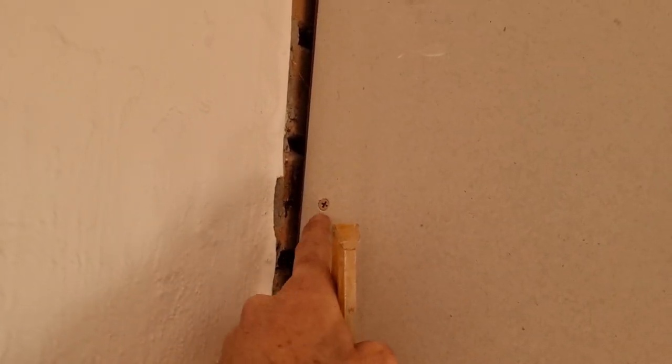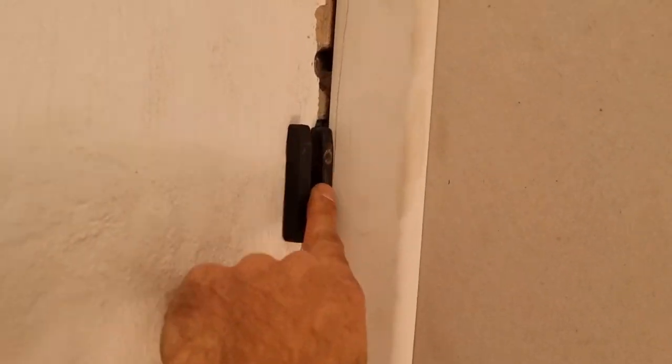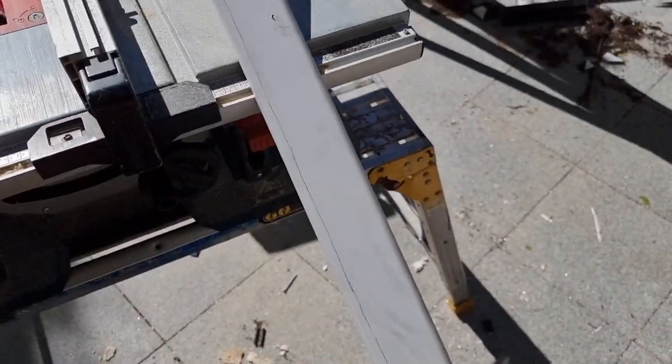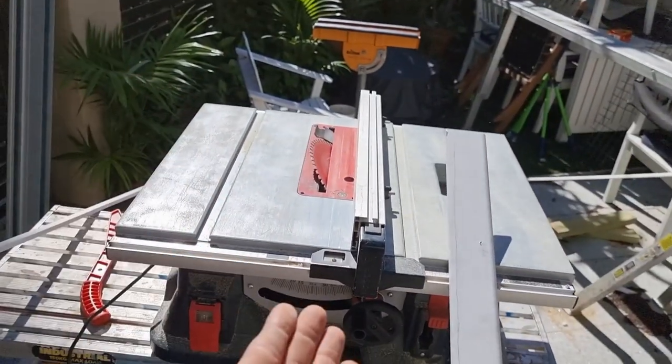It looks like they actually bricked up to — it's a bit weird. It looks like they rendered this after that was on and rendered up to that, so I didn't actually scribe it. I'll clean all that up and then install that. For the scribe, I just had my 10mm packer up against it, followed that line, and that's my line. I tack it in place using my 10mm packer, then push my gun — with the safety up against that — so it won't fully go through, and then I'm able to pry that off easy enough. Then I'll cut the scribe — first I'll back 45 and back-cut it because all I need is that front touching. I found the tightest point was about 63mm, so I'll cut that all at 63mm to start with. Now that's got that 45 on it, and then I'll go through and cut that line.